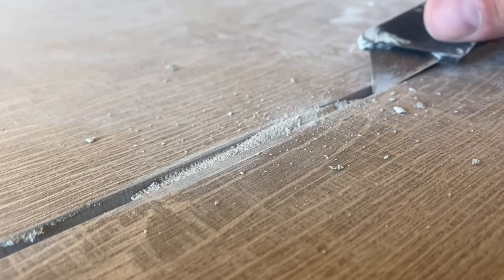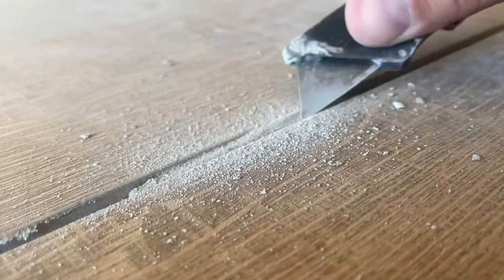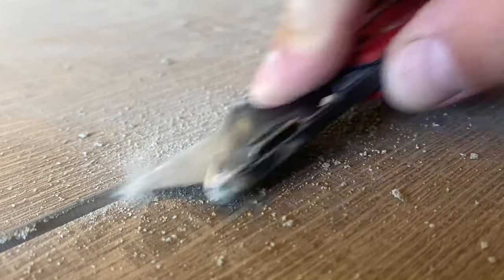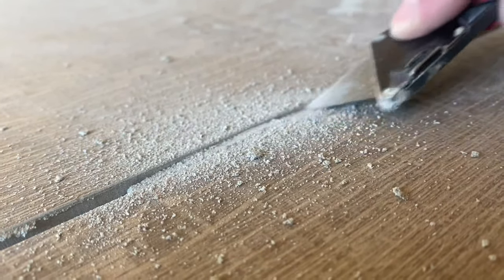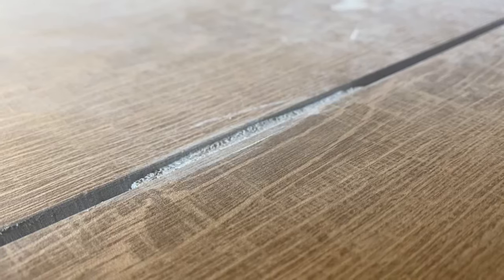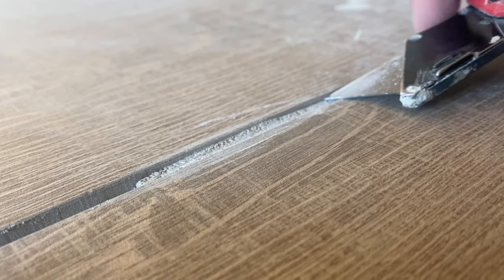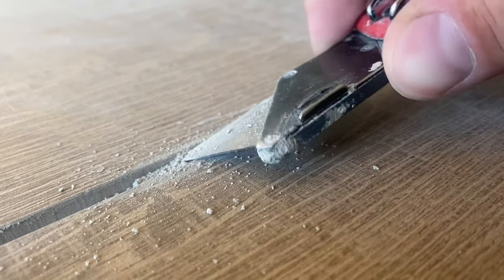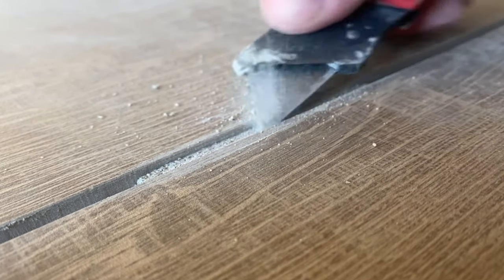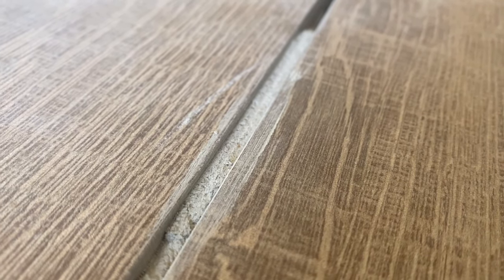Sometimes you want to flatten it down, take the top off, create a groove — flip it, keep it high at first. Then use the corner down: take this corner right here, just come down on that side, it's gonna dig that side off. It's down below the surface now. Same thing — a little sponge action right there and you're ready for grout.